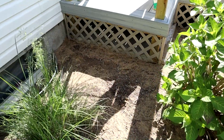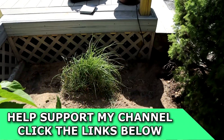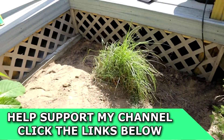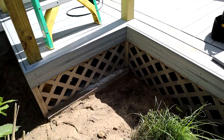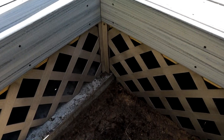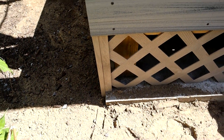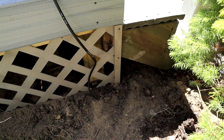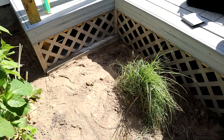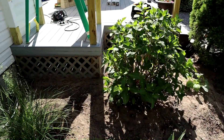So that's a wrap guys — this lattice is all done, skirt board's all done, wrapped around here, looks really good. Ties everything in — the new part of the deck and the rest of it, the existing deck. Happy with the way this came out. Take a peek here, you can see how I did this corner — just two pieces butted together, screws driven in from one side to hold it together. Same type of treatment over here, and I finished it off with another trim piece on this end. That's all good to go, all closed in. Thanks for watching, see you in the next one.